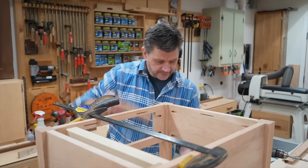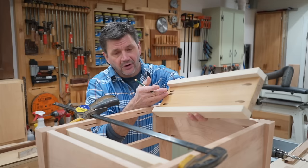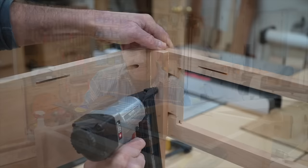While the glue dries, I decided to make some half-inch by inch and a quarter shims that will help position the drawer supports during installation. After letting the glue set for about an hour, I can take these out of the clamps. I'm attaching the inch and a quarter by half-inch spacers between the leg and the drawer slide assembly — that prevents shifting while driving the screws and also adds significant strength to the table, creating a large glue joint tied to both the apron and the leg. Using a little wood glue, I'll attach the spacers with three-quarter inch nails.